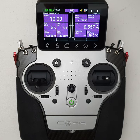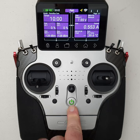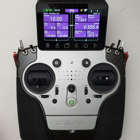Let's talk about the main switch. In PowerBox fashion, they don't have a standard on/off switch. To turn the unit on, you have to depress this button for about three seconds. The LED inside the switch will turn red and flash red. You press it again and the unit boots up.